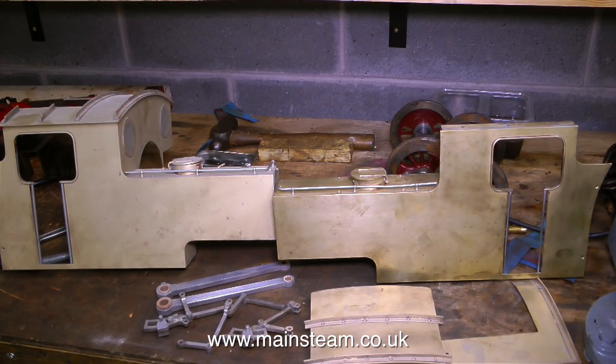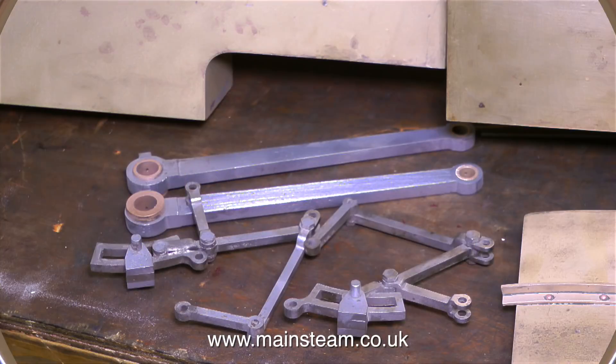Just look at the result. The part on the right is the one that Dave did a few days ago and on the left is the part that I've just done — it's still a bit on the dusty side. I really enjoyed doing this; it's the most satisfying thing I think I've done for a long time. The principle is that the machine blasts a stream of glass beads at the work, which not only completely removes the paint but removes rust as well. So I also used it on the connecting rods and the rest of the valve gear. The coupling rods in the last episode were done by hand in the vise, but as these connecting rods are tapered they're more difficult to hold, so I used the bead blasting machine. I will go over them with some emery cloth because the bead blasted finish is not ideal — unless I was going to paint the rods, in which case it's a perfect finish for painting.